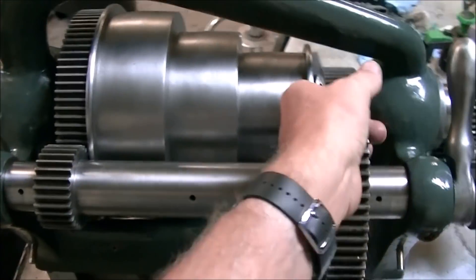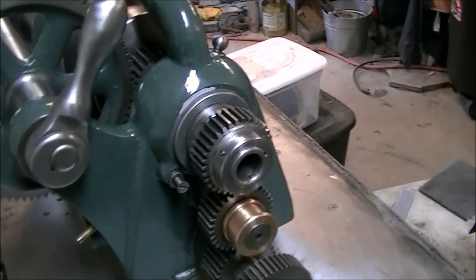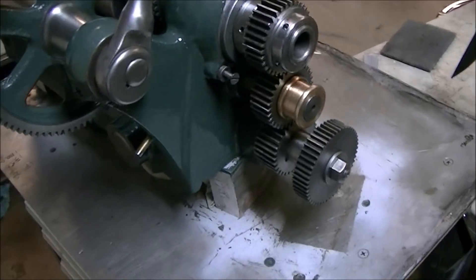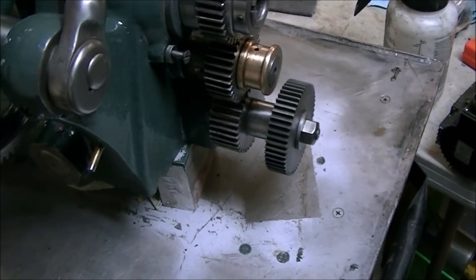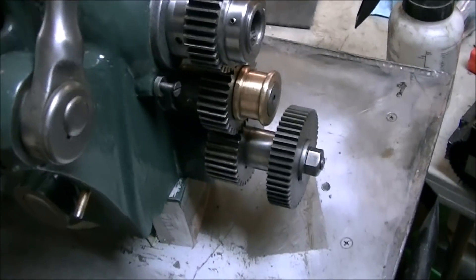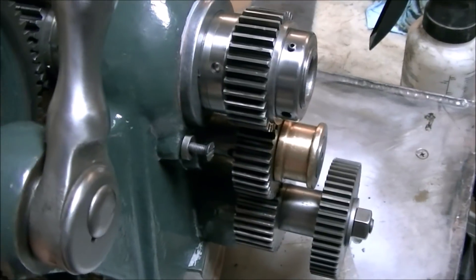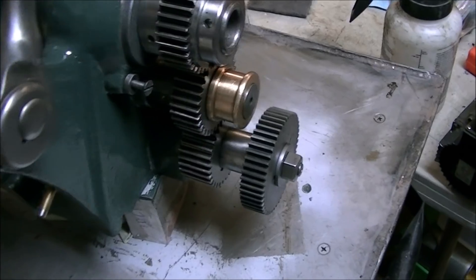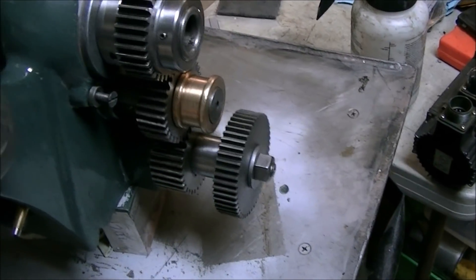There's the pin that engages to lock the bull gear to the cone pulley when you're out of back gears. There's the headstock in back gears — that gear can be pushed in to disengage the drivetrain from the spindle if you're doing an operation where you don't need the drivetrain running. It's kind of nice to run it that way because it's a lot quieter. Here I just reached my hand down under the casting and slid that single-tooth dog clutch to the other position.